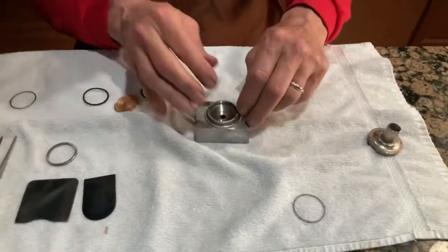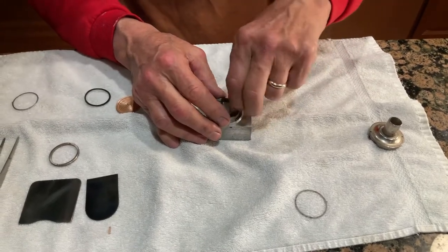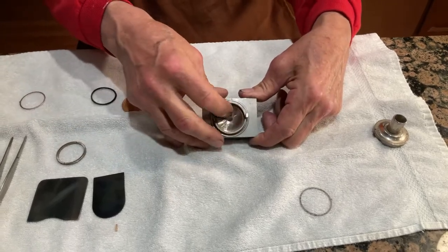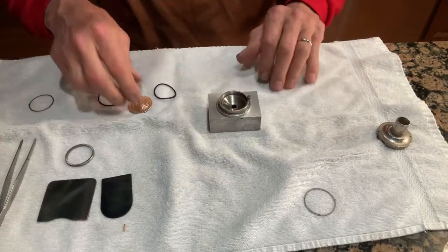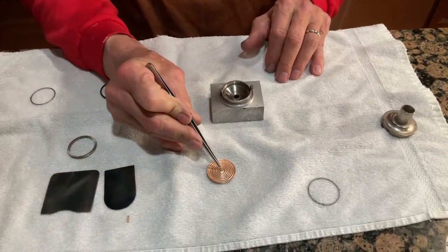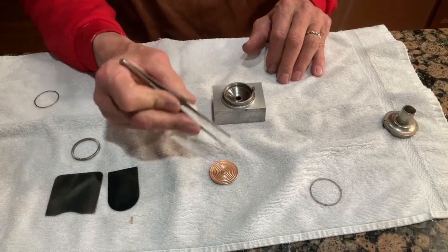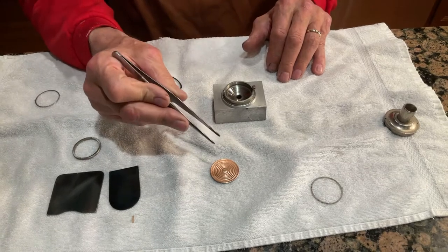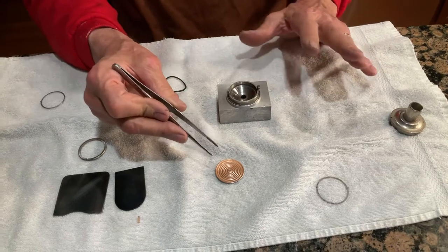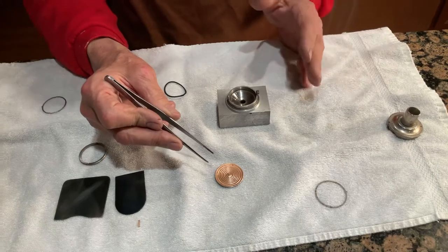This piece in the back is called the hinge block, just like on a diamond disc, and it needs to pivot. Put it in at the start of the rebuild, turned so it's out of the way. The diaphragm has a little piece of metal sticking up with a hole that the linkage hooks to, which then hooks to the stylus bar. A Model C is one length and a Model H is another, so when ordering a linkage you need to specify which model you have.